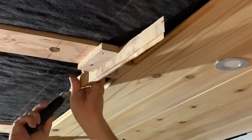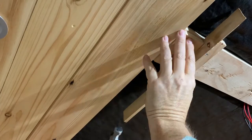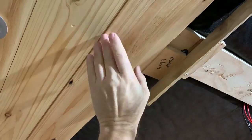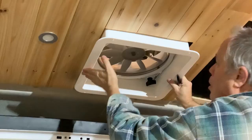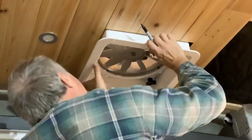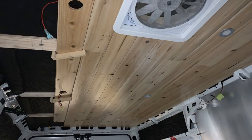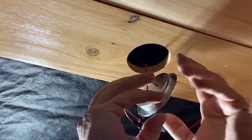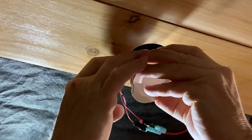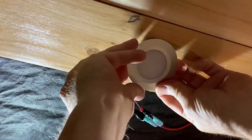Here I'm taking the bow out of some less than straight tongue and groove cedar. This became very frequent — it wasn't necessary for every seam on every rib, but I'd bet I did it more than half the time. For some reason it was very rewarding to install the fan shroud — it really finishes the area off. Off camera I used a table saw to cut it down to the correct depth. Here I'm just getting started on the second set of three pot lights. Here's a close-up of how they snap into place. If you're interested in these pot lights, there's a link in the description below.